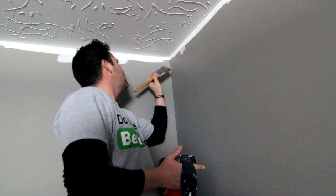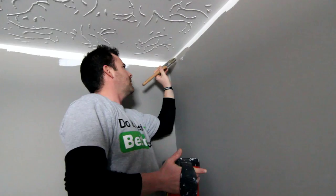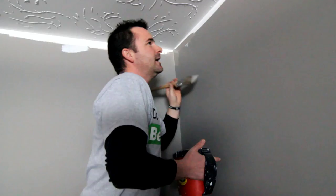To do the inside corner, I just apply a little bit — about half an inch to an inch below — because I don't want an excess amount just bubbling all over the place. Then I'll actually start to do my cut in. I'll just work the tip of my brush up to that inside corner. That's the hardest thing to do. On your first coat, you can keep it down a little bit, and cut it a little bit higher on your second coat to really tweak it and get it where you want it.